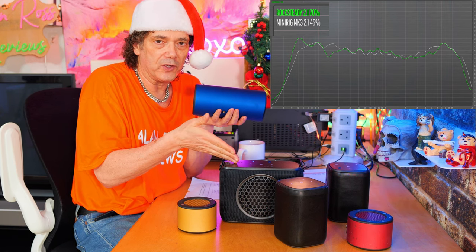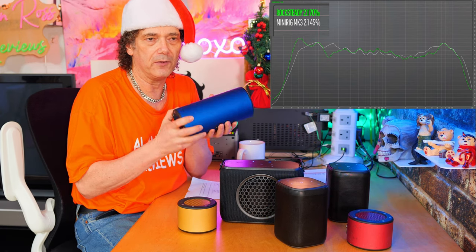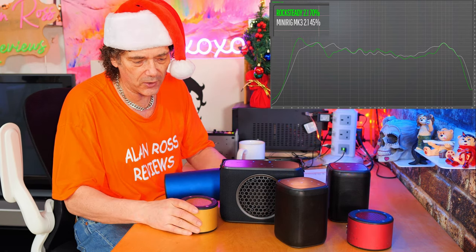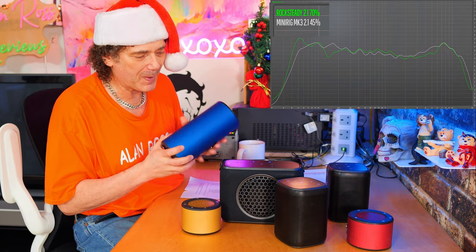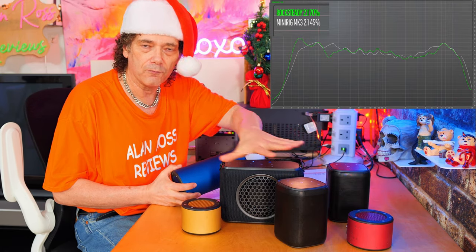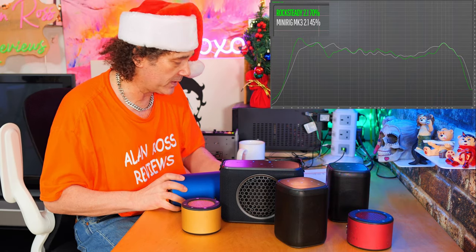This is beefy at all volumes, and in fact, from the frequency response measurements, you see there's a hell of a lot more adjustment at low volume than there is at high volume. It's the opposite on the Minirig Mark III. It does most of its work at the high volumes where the Mark IIIs start reducing the bass. They do carry a decent amount of bass weight at low volumes. And so, because we're playing these at low volumes, to match the volumes of the volume-limited Rocksteady 2.1 system, you're limiting what the subwoofer is doing, and that's one of the problems.